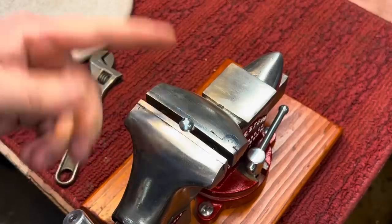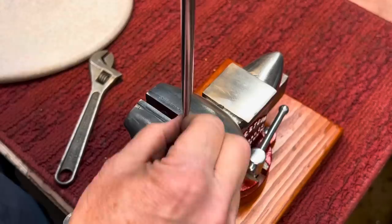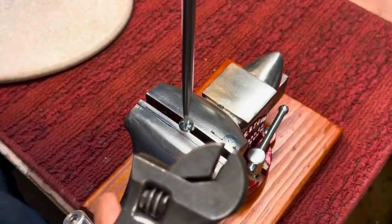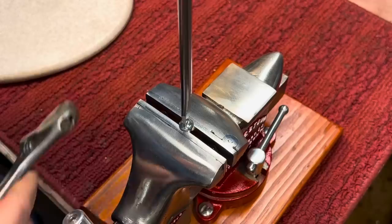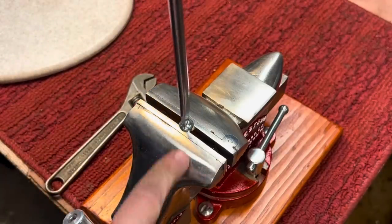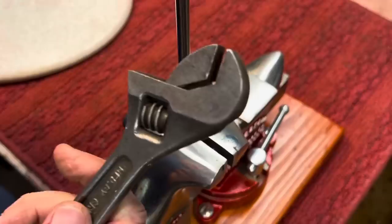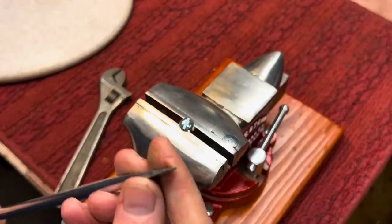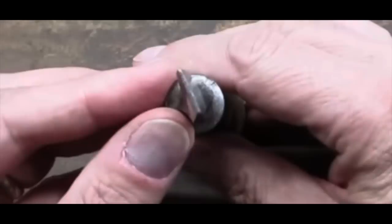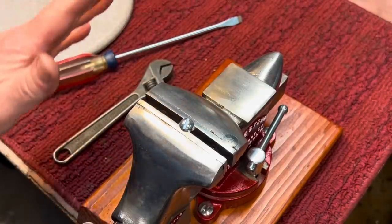Years ago, when you didn't have an adapter like that, some people would use the vice grip method — clamp onto the shaft and turn it that way to give yourself extra torque. But let me show you what a lot of times happens and why you might get a twist in the outer edge of your flat blade screwdriver. This usually happens on a flat bladed screwdriver because the Phillips just doesn't have the ability to torque — it'll just cam out. If you put the screwdriver into the screw and take a wrench onto the blade just above the screw and torque it that way, that is absolutely acceptable. The problem is with a really strong or jammed fastener, because the wrench kind of blocks your vision of the blade, a lot of times you'll feel it move a little and realize the fastener didn't move — but your blade got twisted. That's why I laughed watching 357's video. As soon as he showed it he said 'how would something like this happen?' — and I said, I know, I've done it. I'm the king abuser of tools when I was a young man, but I've learned my lesson.